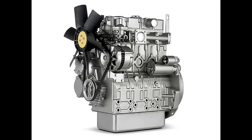Interesting. So it's not just about replacing parts, it's about restoring them to proper working order. Exactly. Mechanics had to be skilled in using specialized tools to grind the valve faces and seats, ensuring a tight seal, to prevent compression loss. It's fascinating how much care and precision went into maintaining these engines. It really is. It was an art form.